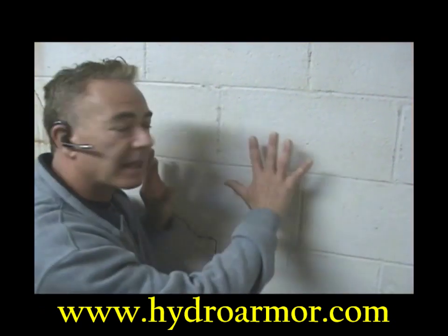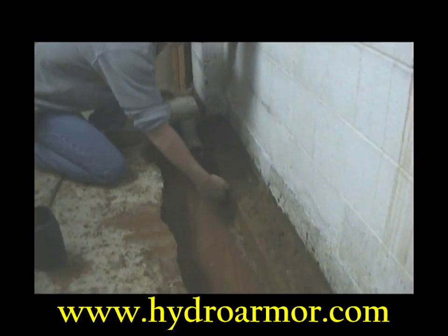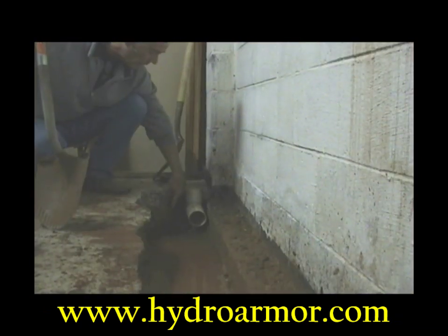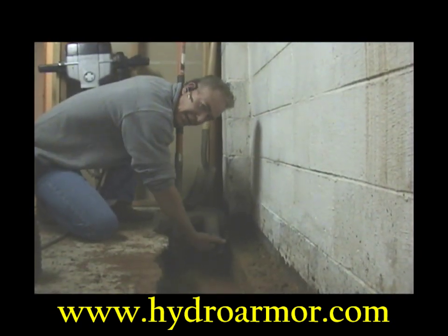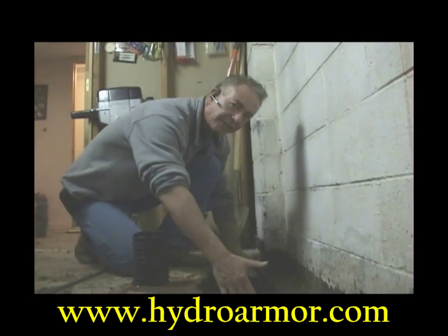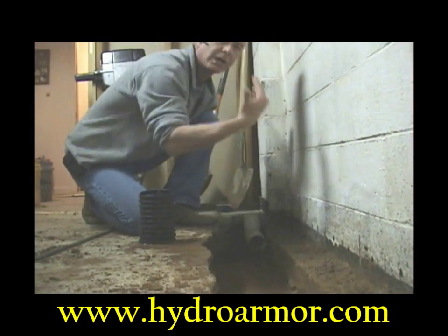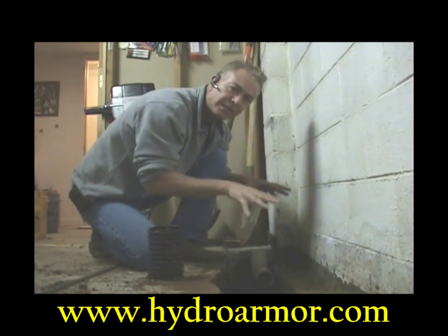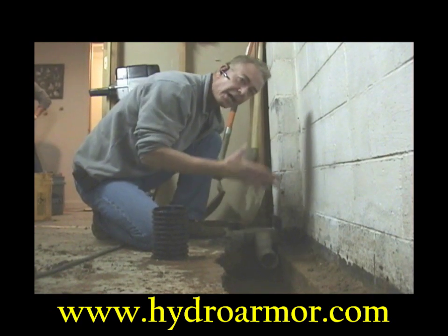It's still building up, and that's why the wall is continually being pushed in. This is the proper width of a trench — minimum 10 inches. A spade shovel is roughly 9 inches wide and needs to fit in there. This is the width of the trench that was put in — it's about this wide. They didn't go wide enough and did not go deep enough. Down here is where the water is, and I've got all this water coming in from outside. All of this water is sitting outside pushing on this wall — lateral pressure. This is supposed to be a pressure relief system, but when you install a 3-inch PVC pipe, not deep enough, not wide enough, it cannot do its job.